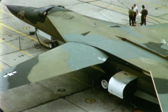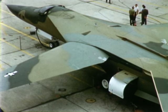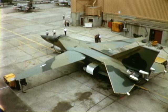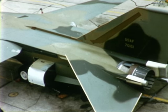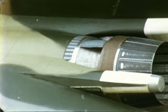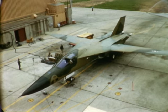This bomber version shares the same basic fuselage as the F-111A tactical fighter, but there are several important configuration differences. The wingspan of the FB-111A is 7 feet more than the span of the F-111A. Having longer wingtips, the wheels and brakes are larger, and the landing gear has been strengthened to allow greater gross takeoff weights. The engines are the TF-30 P7s. These engines have a higher thrust than the TF-30 P3s that are in the F-111A version. The additional power accommodates the SAC higher gross weight and range requirements.